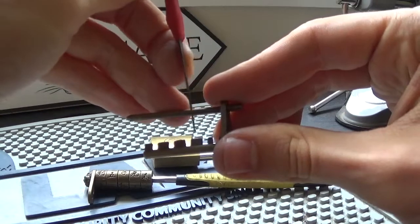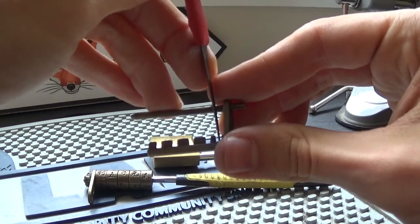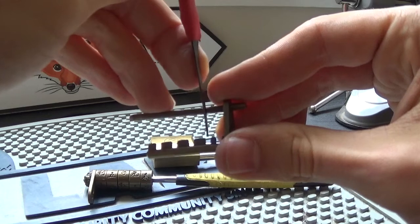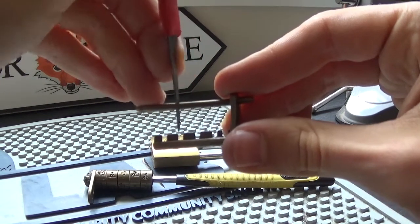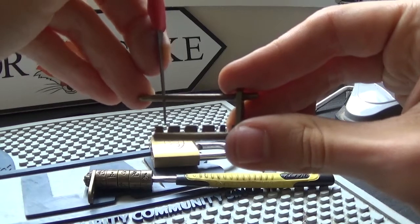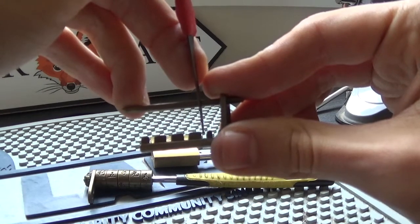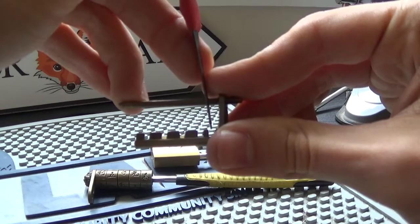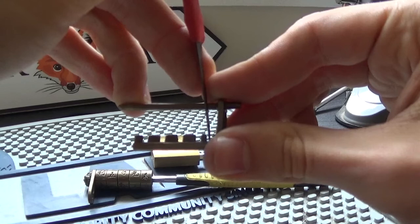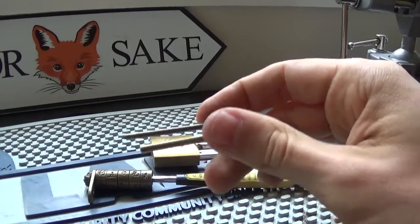When you align the wheels properly on the right number or character, these gaps are no longer blocked by anything. You'd have a space on each wheel, and that space is called a gate. Some locks have a false gate, which kind of half-fills the gap. So you have the true gate which doesn't fill the gap, the false gate which semi-fills the gap, and the no gate which completely blocks it.